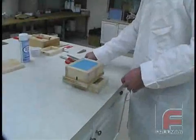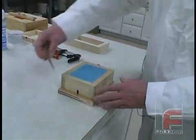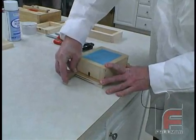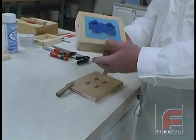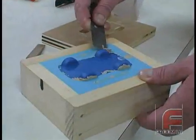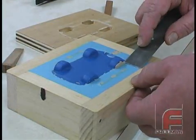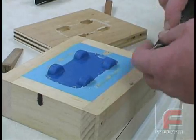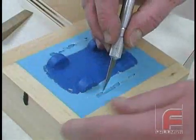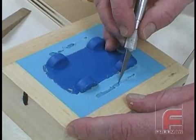It has been 16 hours since we poured the first half of our mold and the Rhodia V340 has now solidified. Here we are taking off our clamps and then wedging apart the frame to reveal the underside of our pour. The first thing we must do is remove the residual clay with our fillet shaper tool. Notice how the clay has prevented the silicone rubber from pouring underneath the model, resulting in a very clean parting line for our second half. Next we remove the locking mechanism. A little bit of the material has flowed underneath the half-round pattern wax, which we can cut off with a knife.